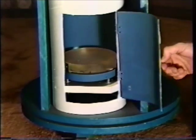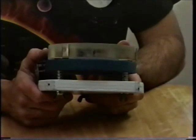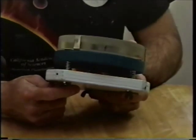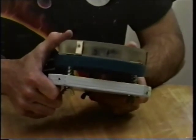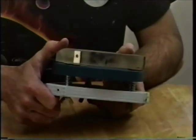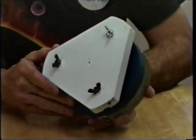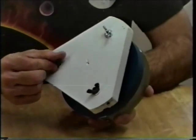We've reached the point where we're ready to align the primary mirror. Here's a typical example of the installation — one kind of mirror cell where a threaded rod passes through the back plate and has a wing nut. As you turn the wing nut, you pull the screw down, and pulling the screw down causes the mirror to tilt. If your mirror cell has only three screws protruding at the rear, it's probably a design like this, and it's safe to adjust collimation by simply turning the screws in the back.